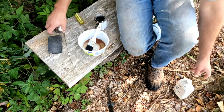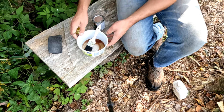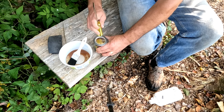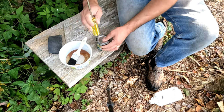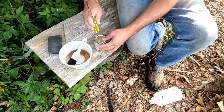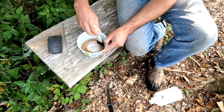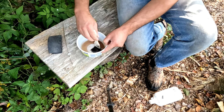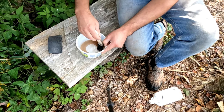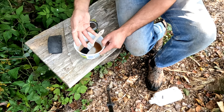Okay, that's all. What that'll do is help thin the paint, making it thinner, and it'll help it penetrate the wood, get in there, right? My first coat, I want it to get in, because the second coat isn't going to penetrate as much as the first coat. The first coat will be in the way, right? So by thinning the paint with some sort of thinner that will act as a solvent for urethane, turpentine's fine, I'm just making the paint a bit runnier, so it'll go deeper into the wood.